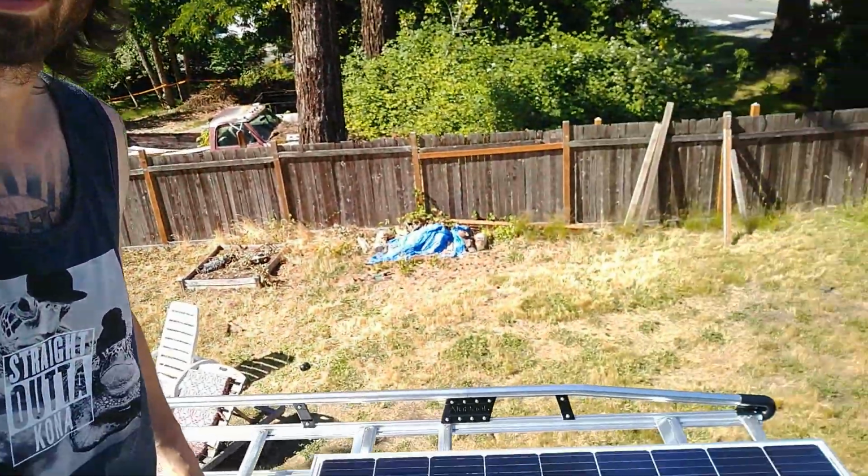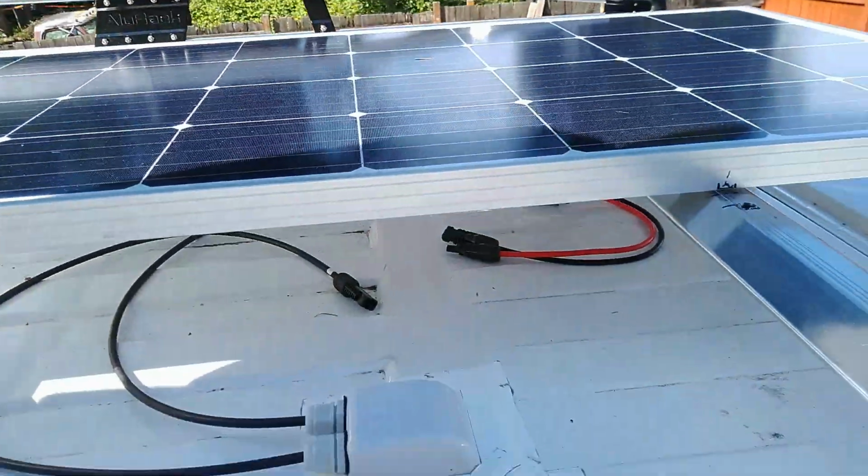Guys, after I don't know how many hours of being on this roof, we got our first one bolted down. I gotta go through and tighten it all now, but that's bolted down. I had some leftover Turnabond from when I did the ceiling fan, so I used that around the entry gland. That looks really good. After I tighten this down, throw the other panel up, hopefully it fits, and then do the deck.